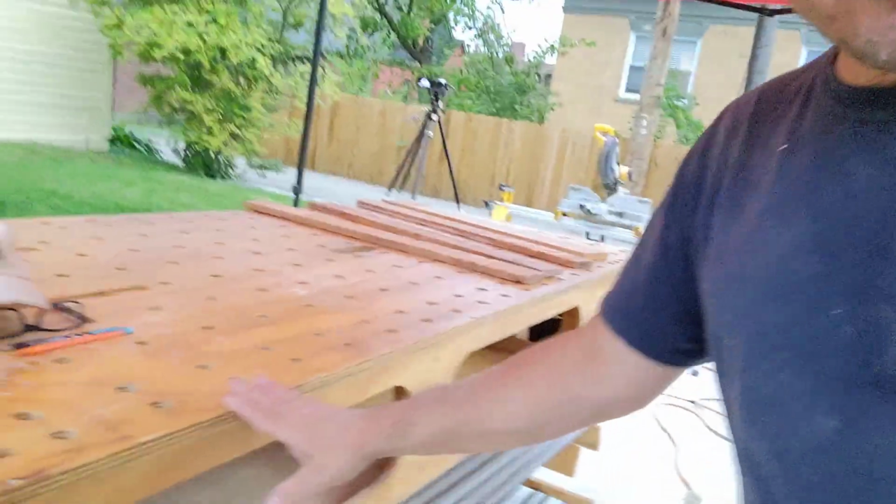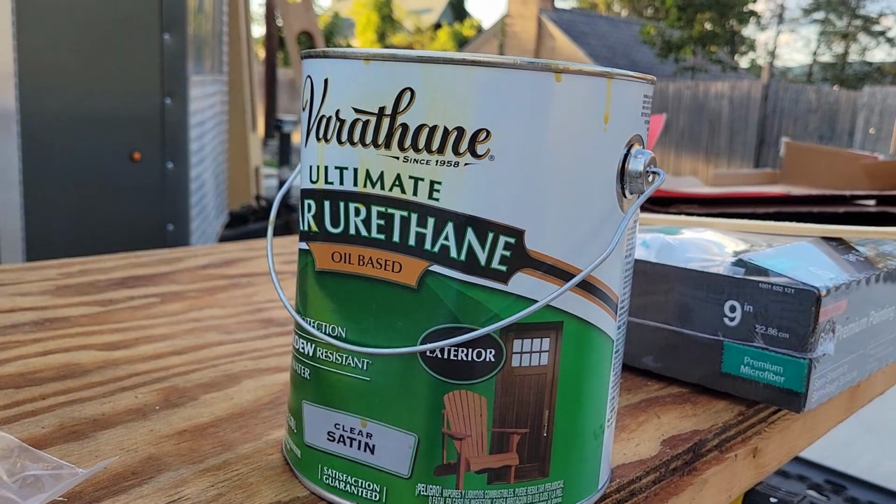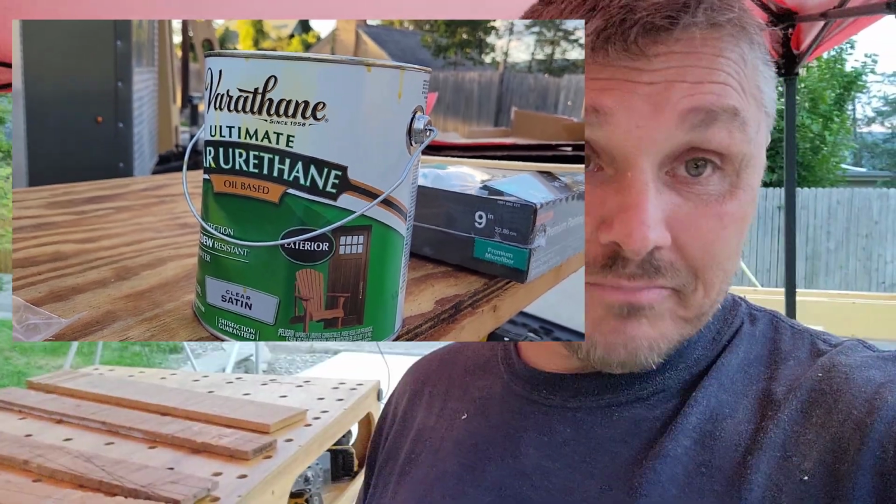The reason why this is a little bit darker, you can see that it's a little bit darker, especially here. You can see that this is really dark. Now, age is a little bit of it, but you notice the blonde plywood there, which is fresh. Probably spring of 2020, maybe fall of 2020, I realized that every once in a while I'd be working and I'd get weather, I wasn't paying attention, and all of a sudden it'd start raining. Well, of course, I'm grabbing tools and I'm putting tools away, covering things up. This bench is the last thing to get covered up, if I have a tarp. So I realized that this bench needed to be able to take some weather. And for that, I went ahead and bought some marine varnish, and I wish I'd done this when it was all apart in pieces, but I varnished the whole thing with this marine varnish, sealed it all up so it can take weather, and it has.